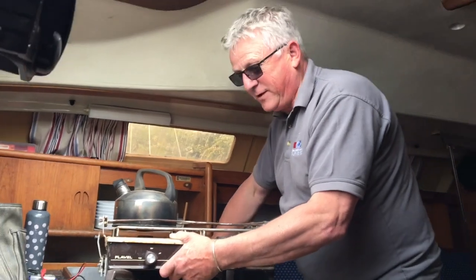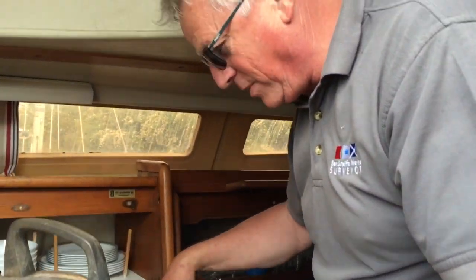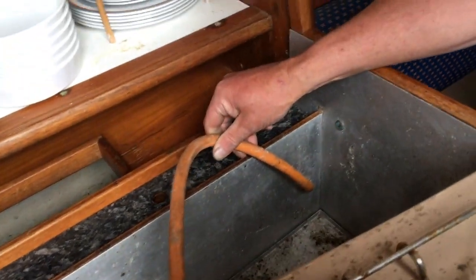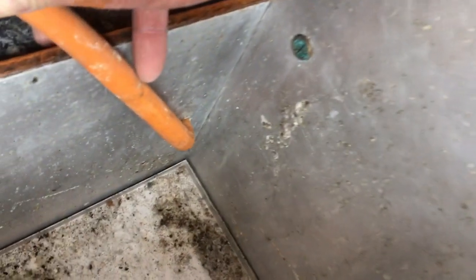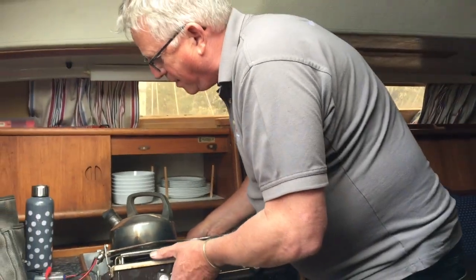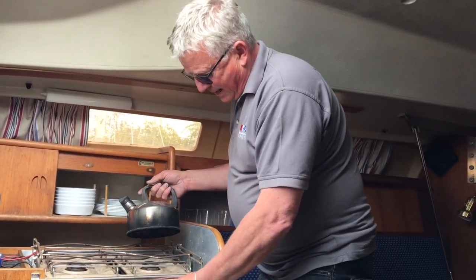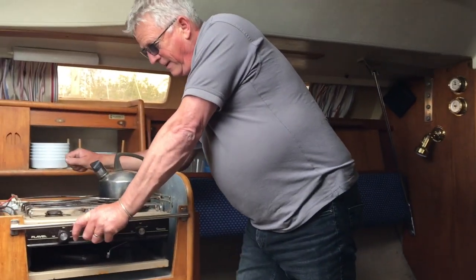This gas cooker - I've just lifted it off the gimbals. It's got a piece of hose at the back here which is actually dated 1984. What's really quite concerning is that for anything that's gimballed, it should really be a reinforced hose. It's come through this piece of shielding - can you see how the gas hose has been cut slowly where it's been through the shielding? So many people have got these in their boats, but a lot of people don't realise there's no thermal cutouts on them. If you're merrily sailing and the gas blows out, gas will freely flow through this without being shut off. Personally, I wouldn't be using this any longer.